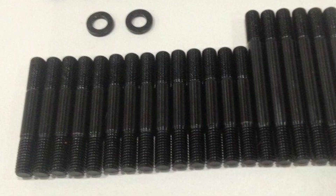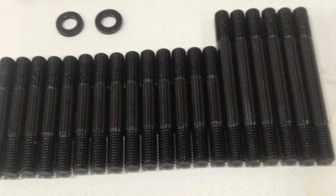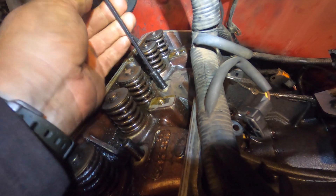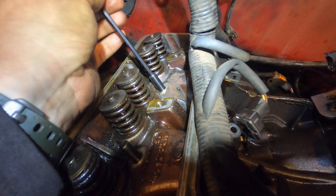So why the big cost difference and why is it worth it? Because of their concentric shape and differing threads on either end, studs just cost more to produce as they require more steps than bolts to complete, plain and simple. This is worth it because all of that extra work allows them to apply torque into clamping force more consistently and efficiently.